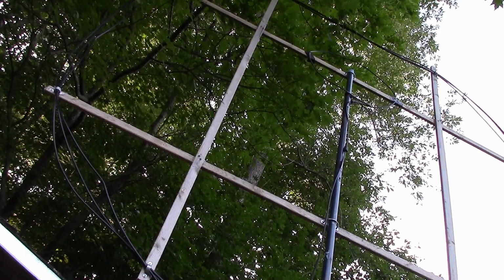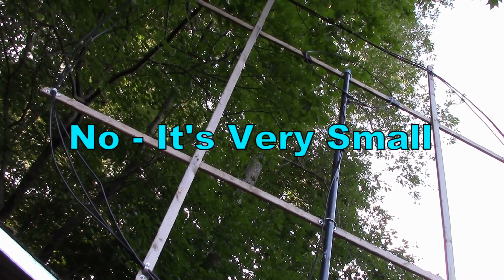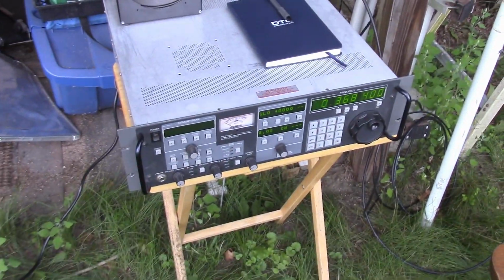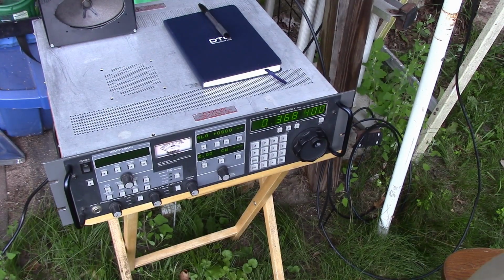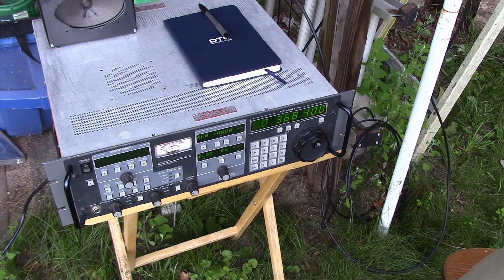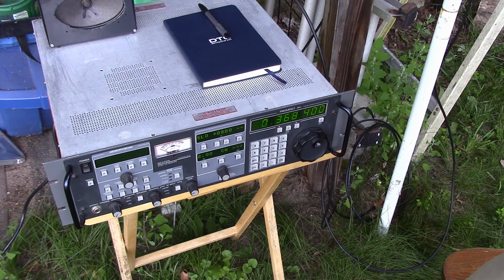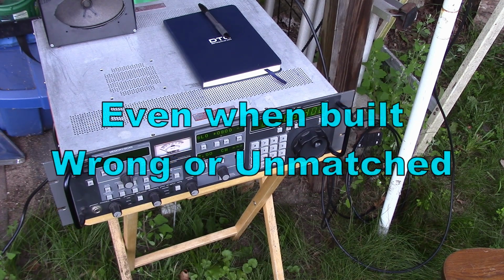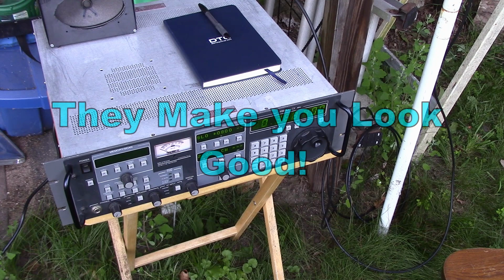That guy's just a little bit too small. We need to increase that again. So let's try to null it out. Of course, at this frequency, the loop looks much smaller, and we get almost a perfect null. This is really working well. So I think the 3 turns is excellent for the low frequency band. It's just we need to increase the size of the pickup loop.